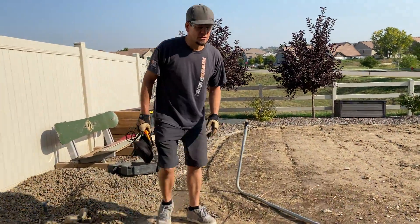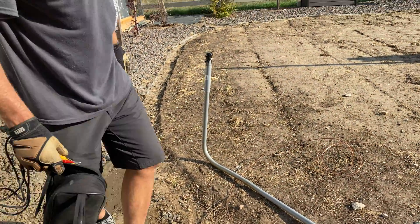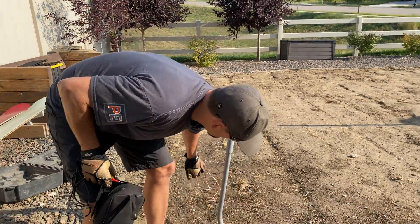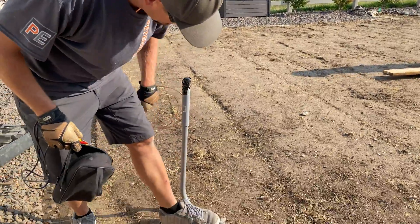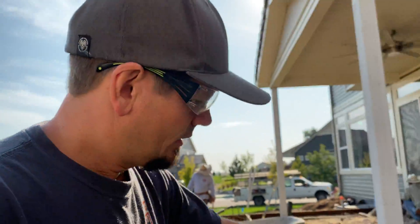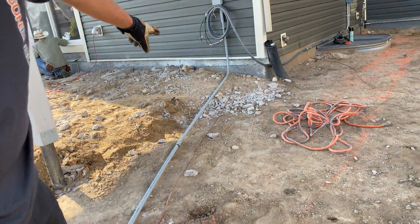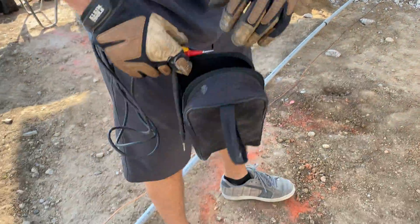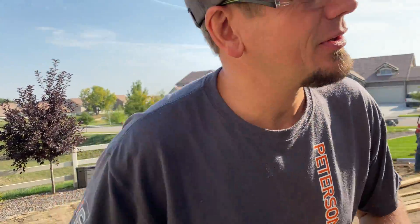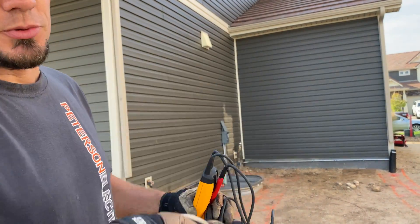In two years he's going to build a stand-alone island here. So we're getting this conduit inspected, and once they level the area he'll put this up and tape it — that's our grounding for the metal studs and for the whole kitchen. Then right here we'll bond to that ground as well, and he'll tape the number four wire next to it. We've got our slip joints installed and taped, so that's ready to go. They'll have to take it out and roll up the wire so they can level, then put it back when they place the rebar.